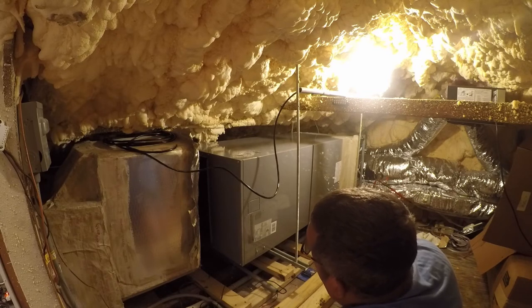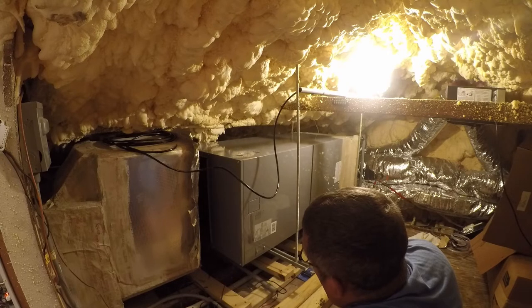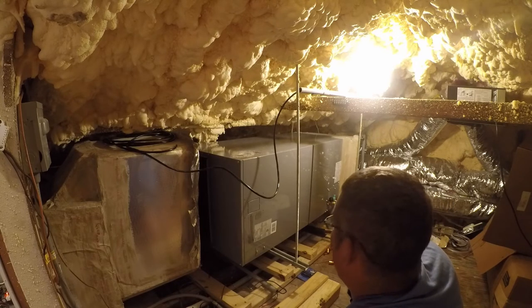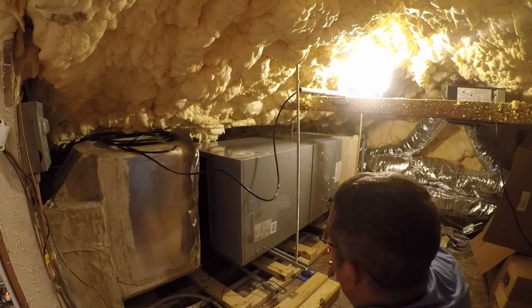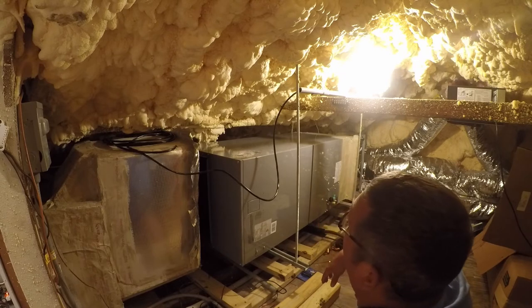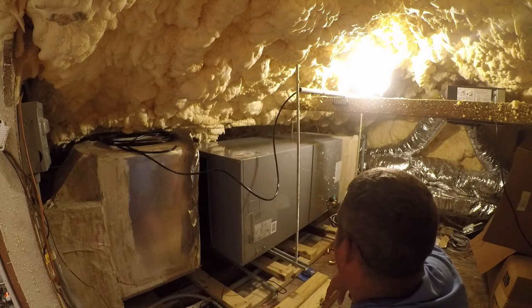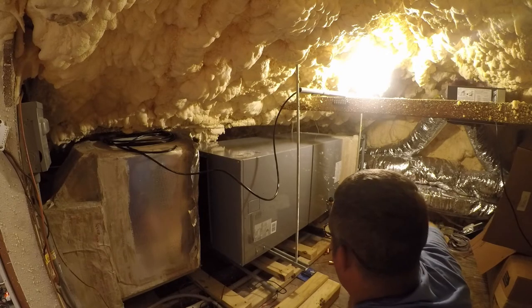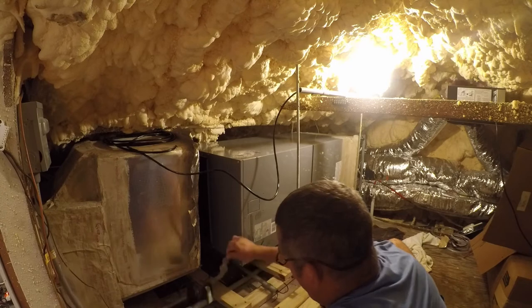In the meanwhile I have to decide how I want to do this — my options are bad and less bad. There's my control wire that will power this; it's going to go in through one of those and then that's going to get all sealed up. I've got to bring in power, so power might as well come in through the top — that way I only have one place, and then I can just seal these completely so dust and dirt don't get in there. I need to install the heat kit. I'm putting in a 5kW heat kit, and the 5kW heat kit has a separate 30-amp power supply to run it.